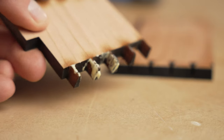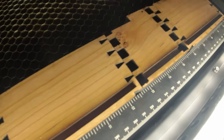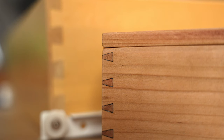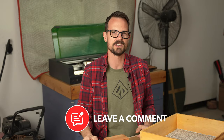The other issue is the aesthetics of this dark line around the dovetails. I think if I was using walnut or a darker wood, it wouldn't show up so much, but with the burning and the glue mixing in, it's really standing out. One thing I was able to do is shrink the pins a ton, which typically you can only do with hand-cut dovetails, and I think that looks a lot more interesting when I compare it to the drawers in my kitchen. Those dovetails are all symmetric and boring, although they are very tight and don't have that line.